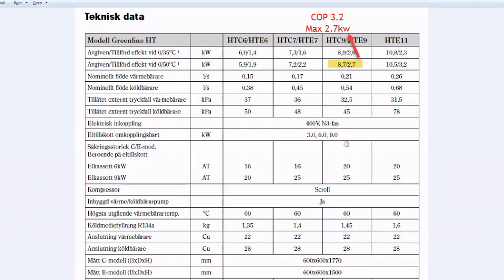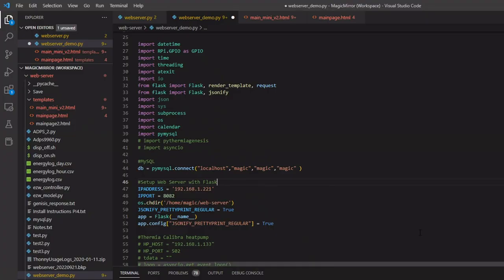There are even more savings. The old pump was actually using more kilowatt-hours than it should — in some cases up to 5 kW — probably because the compressor was old and needed replacement, which costs a lot of money. Given these two factors, I decided to replace it, and I don't regret it. I reduced my energy consumption by more than 50%: the COP factor change alone accounts for 34% saving, and the failing old compressor accounted for the rest.